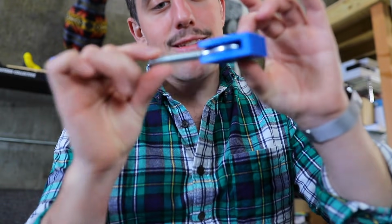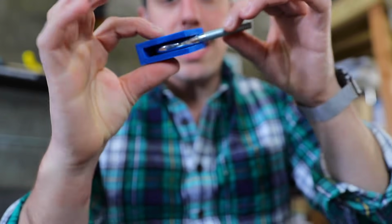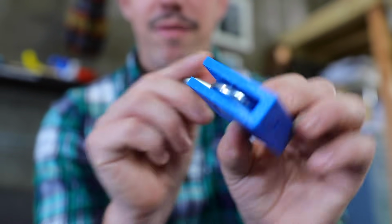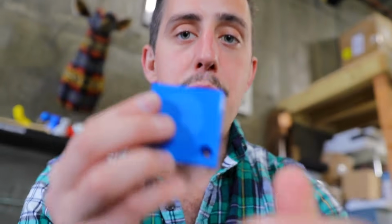I designed and 3D printed this little bracket that uses an eye hex bolt, and it's gonna go on each corner of the desk. And this is gonna be the locking and unlocking mechanism when we wanna flip the desk over. So let's get these 4 brackets attached to each one of the corners and get the framing all cut and set up for the inside of our desk.